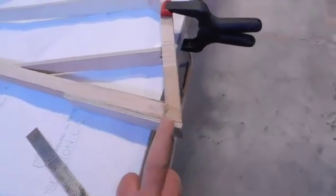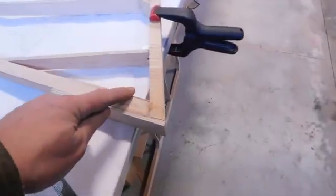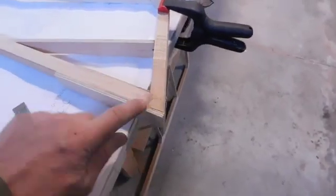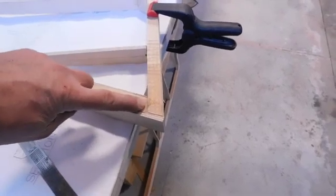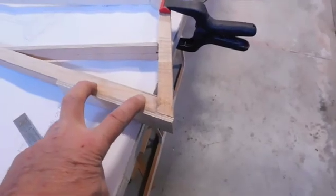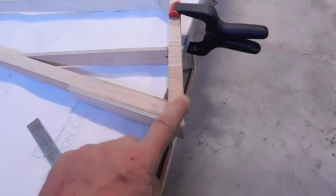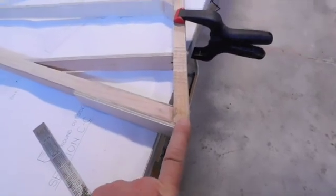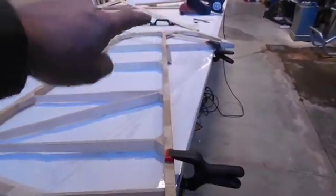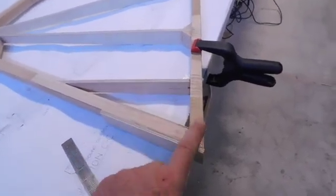I added this piece, and my reasoning is there's no corner bracing here. There is going to be a gusset over top of this, but this joint right here is a butt joint. And when you put the actuator on here, that turning force there will want to pull that apart.